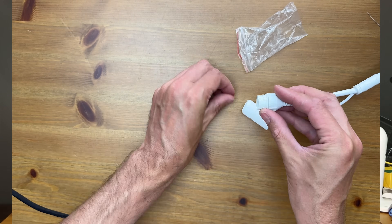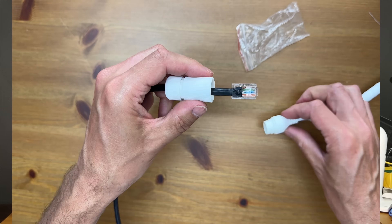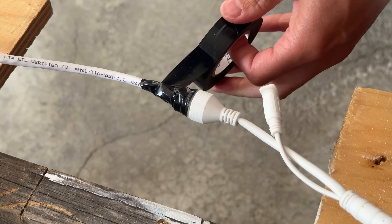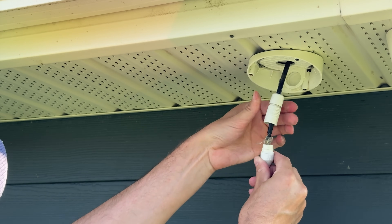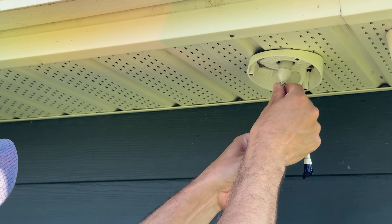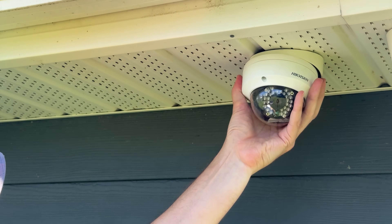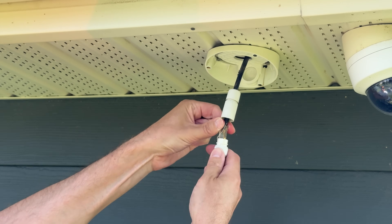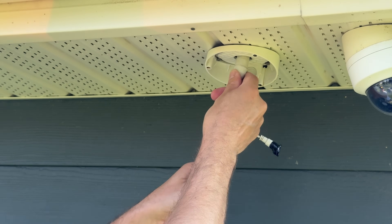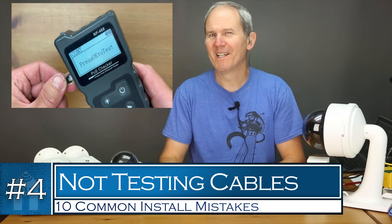Here are some options to avoid this type of damage. Before terminating the cables, add a weather-sealing grommet — all outdoor cameras should have one included. More frequently manufacturers are including a style of seal that fits over the RJ45 connector, just in case the cable is already terminated. If worse comes to worst and you have no grommet, you could always use electrical tape. If your connection point is hidden up inside an eave or inside a wall, keep in mind that moisture may get in there, especially on a windy foggy day. This seal is even more critical if you live near the ocean with salt spray. My general rule is to always protect the connection, inside or out — I like to take this a step further and protect all exposed connections including the DC power port.